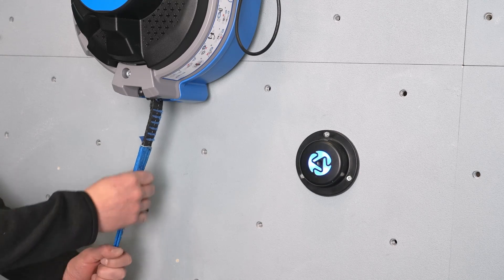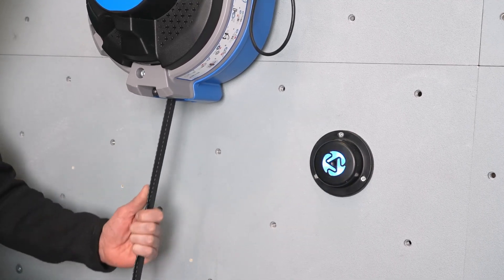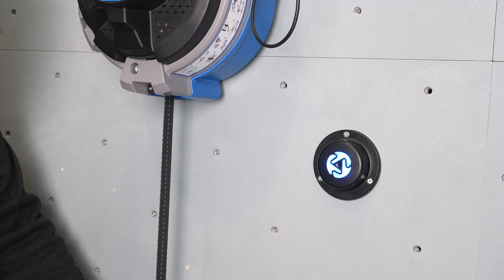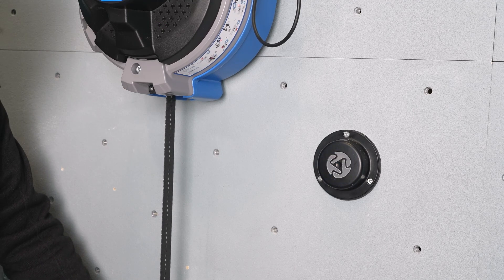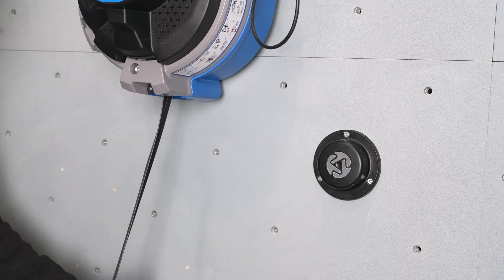There's one final test we recommend running. Start the same as before by gathering a little slack and then pulling down to engage hold mode. Only this time, instead of letting go, keep pulling to simulate a climber hanging on the rope. Then just hold it there. When the preset time is nearly up, the IQ Plus will start to flash — this is known as countdown mode. A few seconds later, hold mode will release and catch-and-hold mode will switch off. That's all there is to it. The installation is complete and the IQ Plus is ready for climbers.